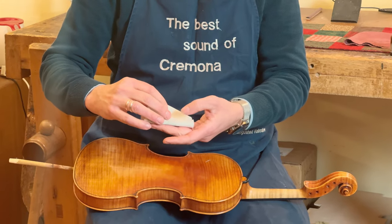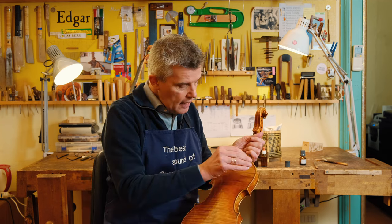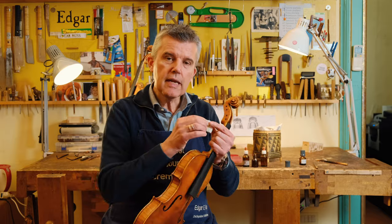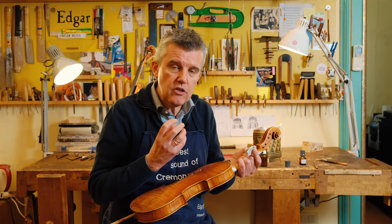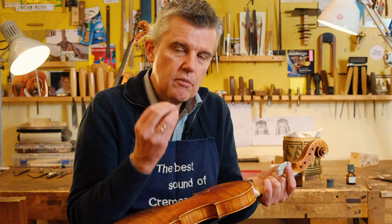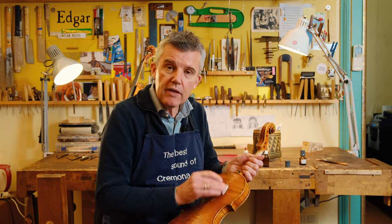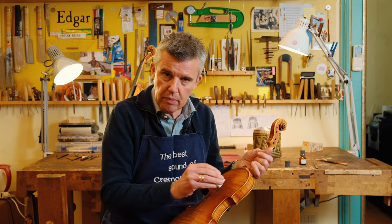With this cotton I put on a little bit of shellac and start applying it on the instrument. I fold it, put the shellac on top, and in the very beginning I varnish the instrument all over with this shellac. You need a certain amount of shellac to fill up the tiny tiny scratches from the sanding we previously did. You need to build up a certain material which is solvable in the solvent — the alcohol. Then with the oil you can move it to where it's needed, which is where it's not yet shiny. That's more or less the theory about polishing.